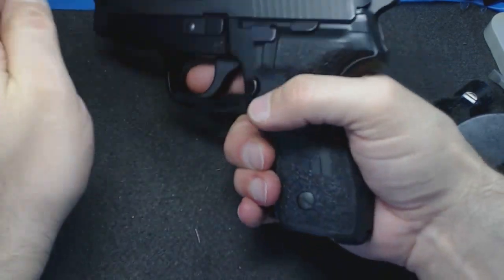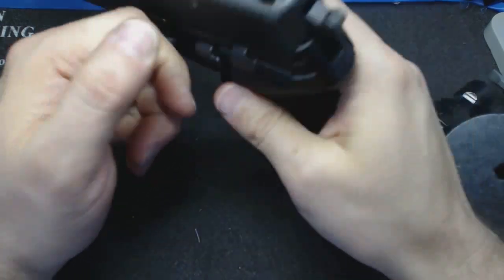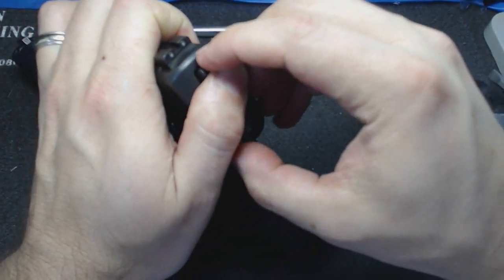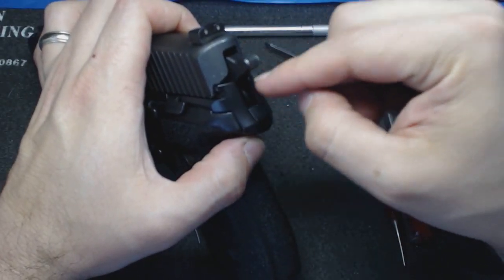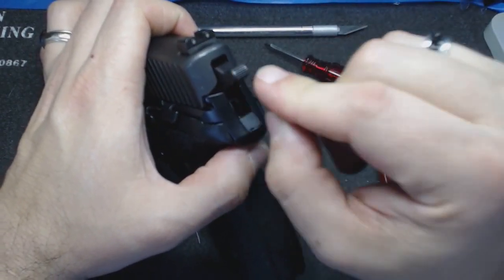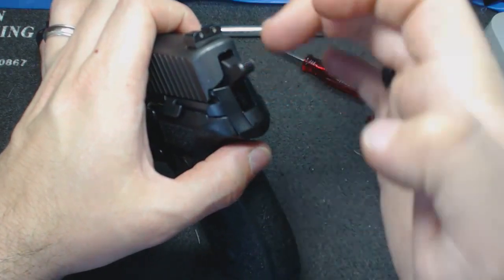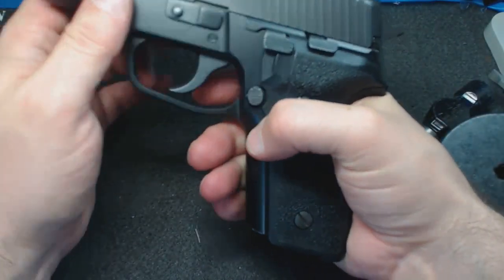And actually, technically, because we used the hammer drop, it's in the half cock notch. If we actually had fired it and something got it forward, that spring is going to actually pull it all the way back till the sear gets in the half cock notch as well. So it's really all about getting the hammer into a position where even if you did drop it, it's not going to drop in any way that can ever transfer pressure all the way to the firing pin.